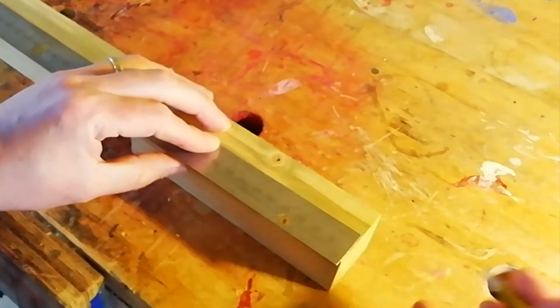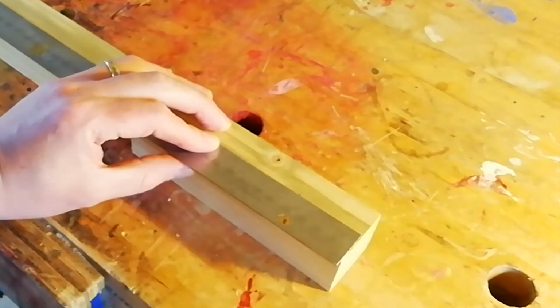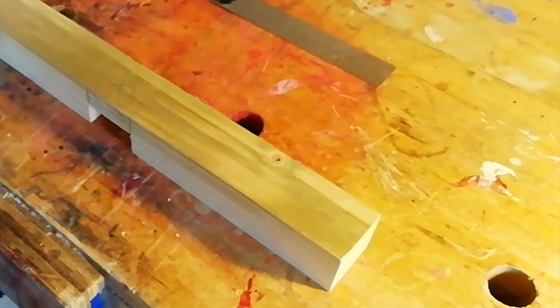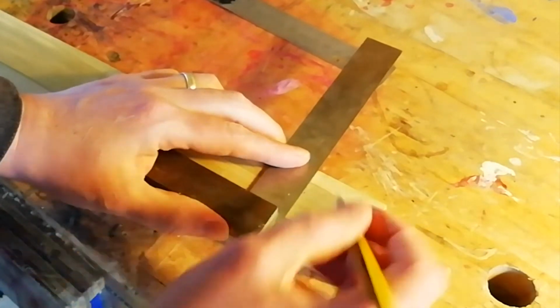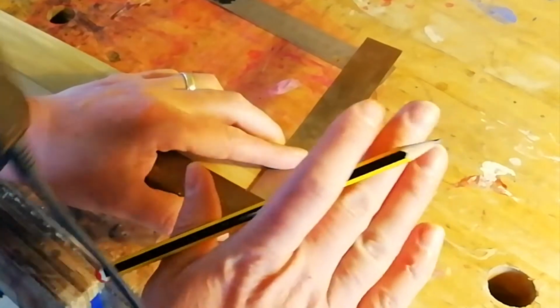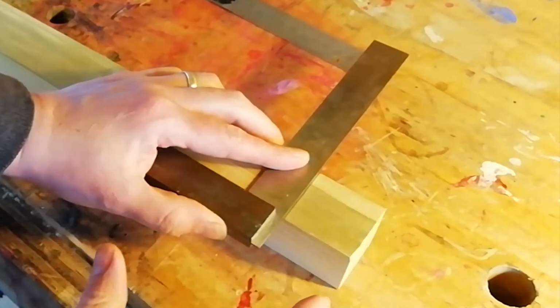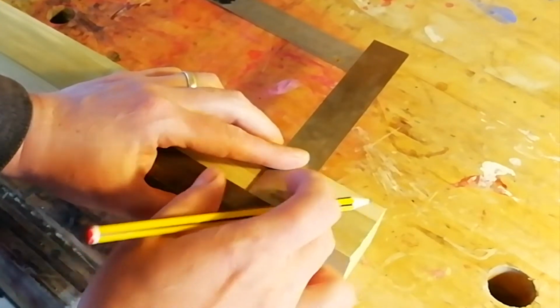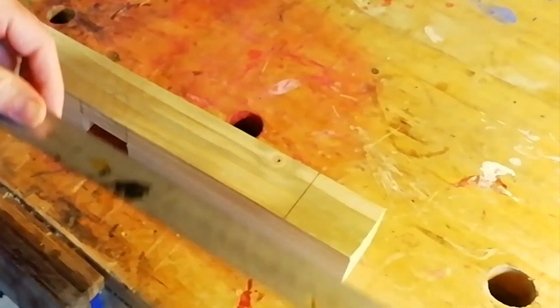of our chosen part, as this is the width of the leg that we are going to have to accommodate in this bridle joint. Once we've marked that out, we can take our tri-square, making sure it's flat up against the edge of the wood, score this across, and this is going to mark the bottom side of our joint. We are actually going to work in a slight angle to our legs here, so we're also going to mark 4mm further along, and we're going to carry this up onto the upper side of our work.